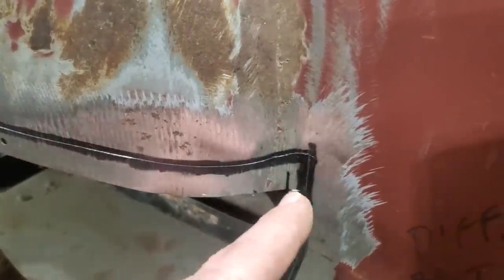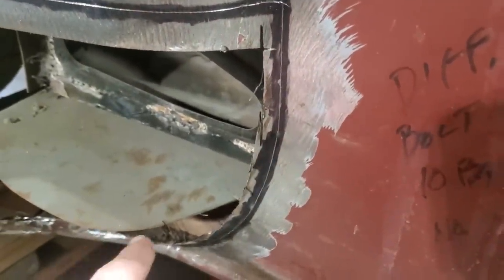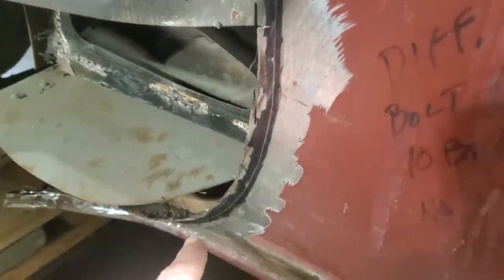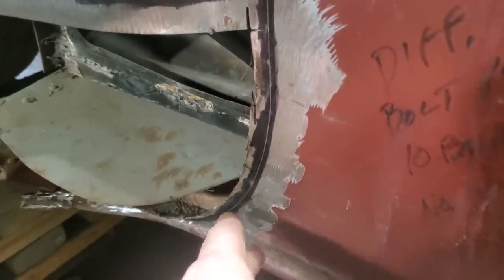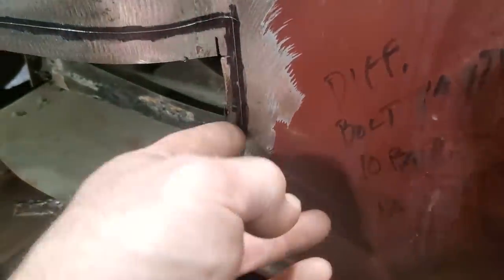and cut it off. And then do this corner, get this cut down this way, come down so far. I might do the whole thing yet, I don't know, because it brings up down there. And then I can work it all the way around. It's going to be hard to cut this curve down here to fit. Usually I do straight panels, but because of the way this is shaped, I want to take it in the roll so that it's less work trying to repair it, or fill it after the fact, because you're inside a rolled edge, right?